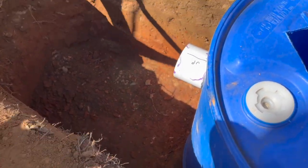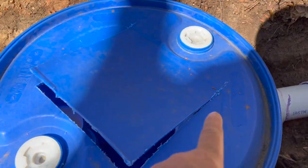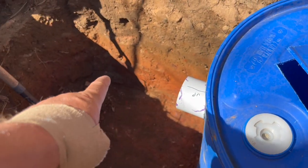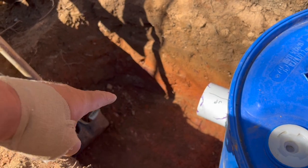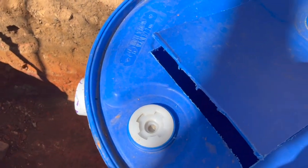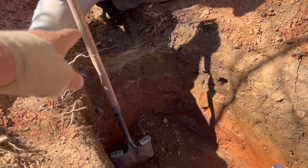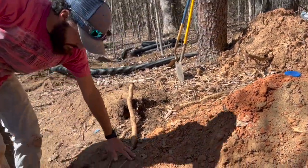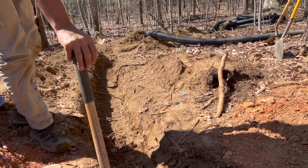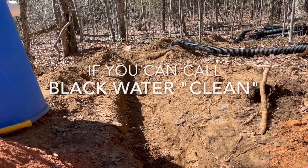The second barrel sits about two inches lower than the first. They both have a high inlet and a low outlet. The low outlet on the first comes into the high inlet on the second, and then two inches lower is the outlet on the second barrel, so the first can only overflow into the second, and the second can only overflow into our trench, which will have black pipe to let the water soak into the ground — that'll be our leach field where the mostly clean liquid comes out.